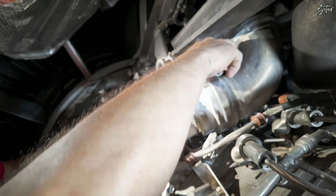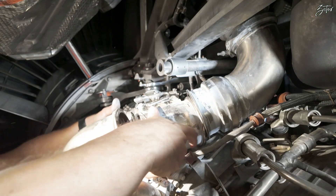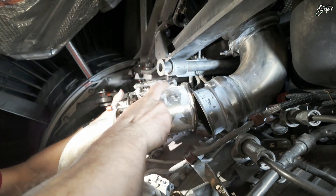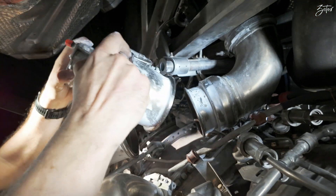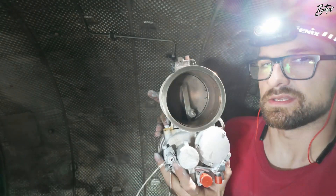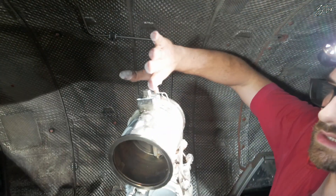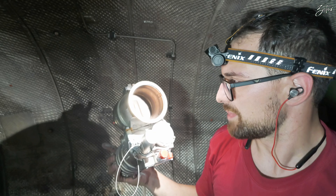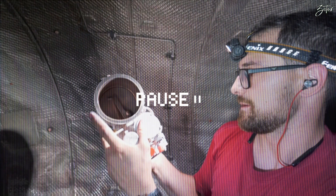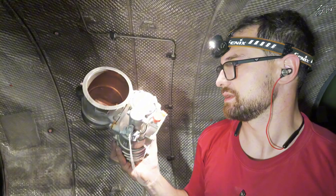Now since the duct is flexible we have a certain range of motion — that's the difference compared to the high pressure valve. We can remove it. This is our valve. It's the same as the high pressure valve — it's a butterfly type, so it turns and depending on the position of the actuator it will either open or close. One small update: this is a bleed pressure regulator shut-off valve, which means it can regulate the pressure by adjustment of the flap.